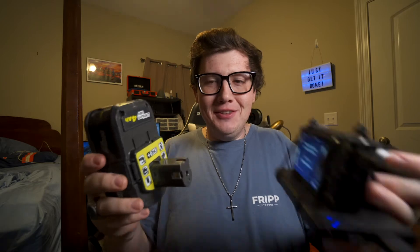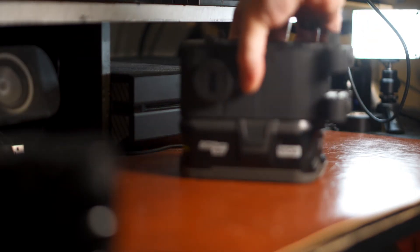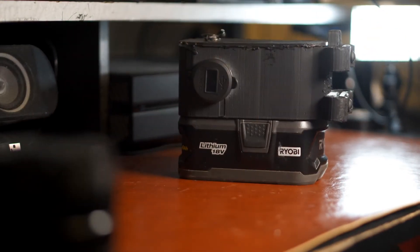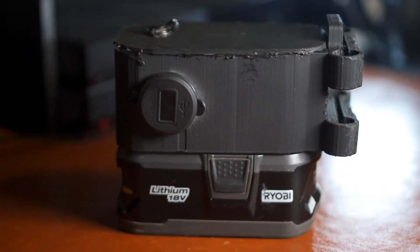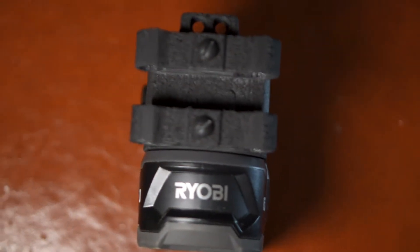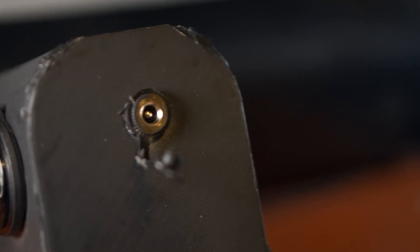What I do have are trusty Ryobi batteries. These things will run forever, and at four amps for a camera like this, that's going to be a bit overkill. So I developed a Ryobi battery mount for the A6400. This uses a buck converter to turn 18 volts into a usable 12 volts to power my monitor and my camera. On the bottom are standard rails to connect the battery to the camera. I also added a USB charging port as well as a 12-volt connector so I can power any lights or accessories from this battery pack.